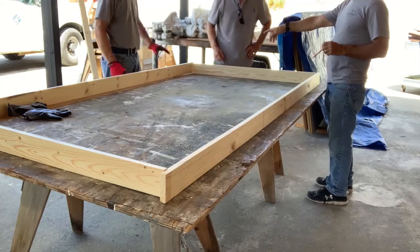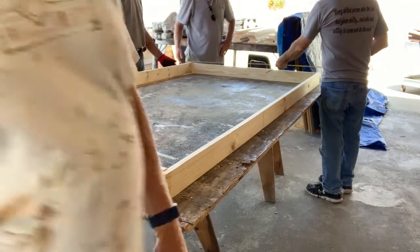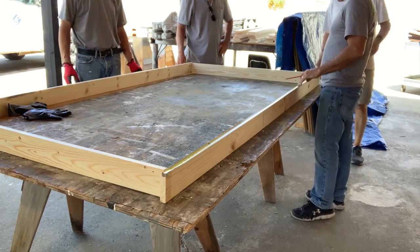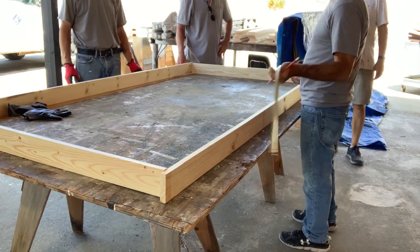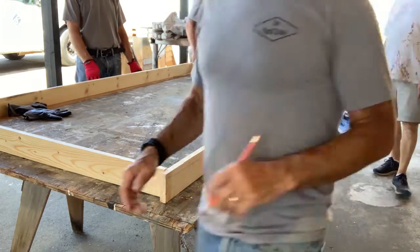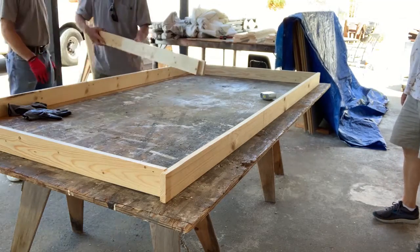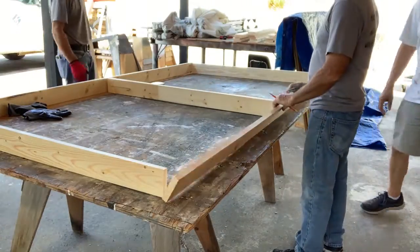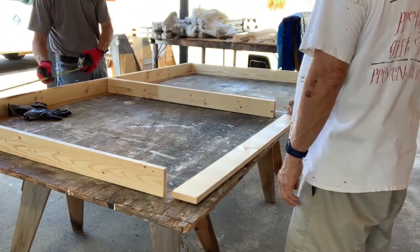The size of the room was about seven and a half by seven and a half by seven and a half feet tall, so it was a custom deal. We wanted to make it in the shop and then bring it in. We framed the whole thing with one by four pine rather than two by fours because we really didn't need to hold anything up — the framing is really just there to hold the sound-killing materials in place. Also, pine is quite a bit lighter than two by fours, and the room was being built outside and then brought in in sections, so lighter was better.